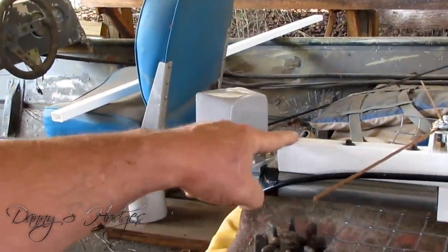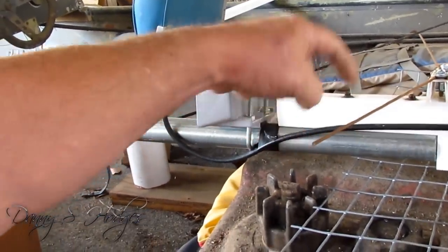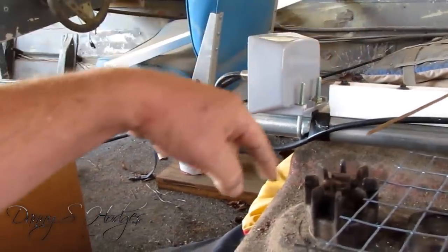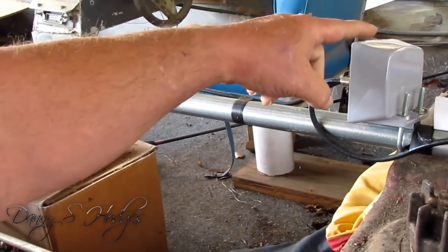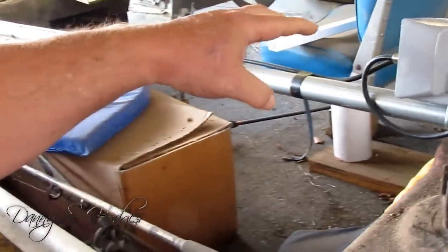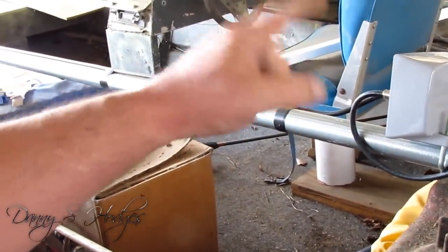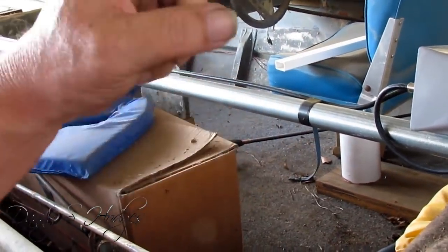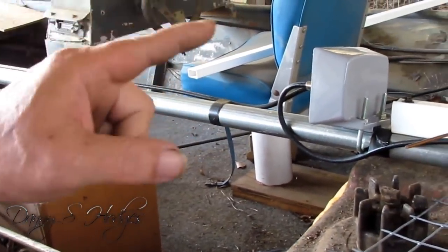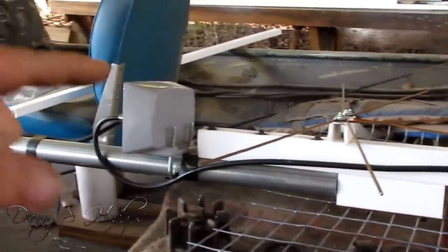And see how I got this screwed to my pole? I got it screwed down, three screws. I drilled it, screwed three screws in. There's a booster I got, a Channel Master booster. A lot of people ask me about that. This is probably the best you can get. This is a 7778. This antenna right here won't run, you can't use that 7777 on this antenna. It's too powerful.